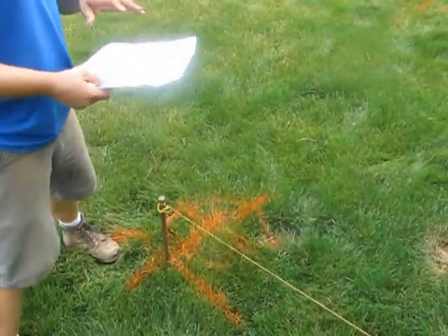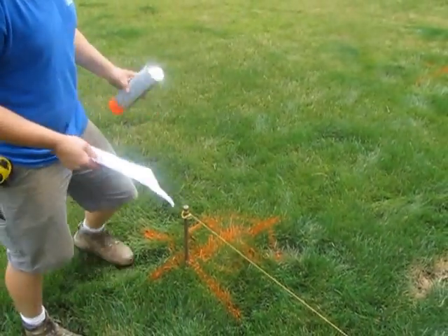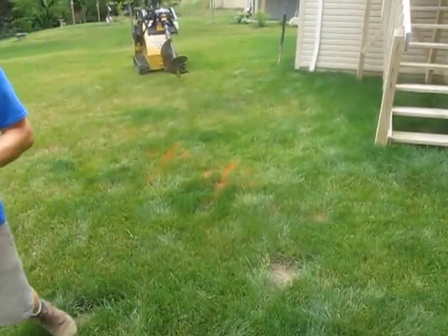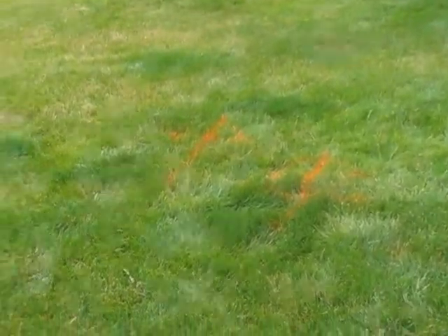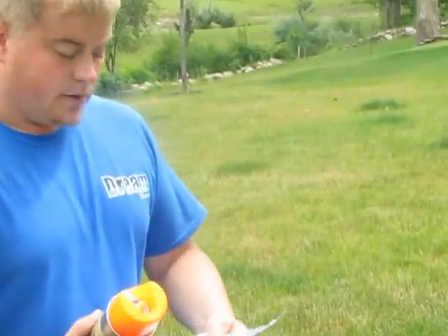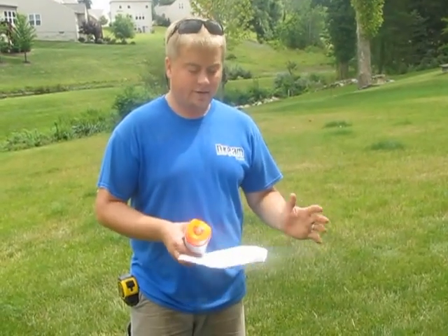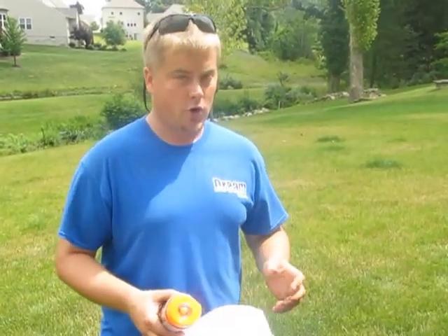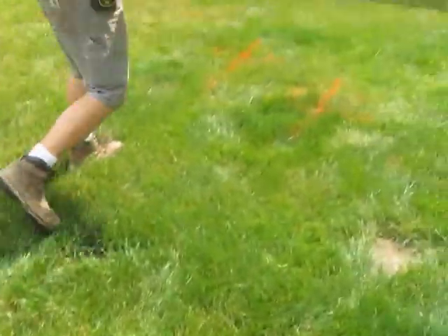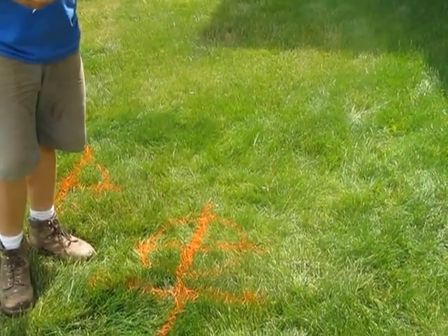From this straight line, I can then pull my layouts. I know my first beam is going to be 14 feet, so I take my spray paint, paint myself a 14-foot line, go from this corner of the house another 14-foot line. Then by using this straight line, I can pull the placements of my actual posts. I always like to keep my posts symmetrical with the beam. Because we want to eliminate too many obstacles from viewing — being with the windows and doors — instead of cantilevering two feet past our posts, we're going to go one foot. So I'm coming in from my string line one foot, pulling the maximum, then returning one foot, creating a nice symmetrical look with my posts on the beam.